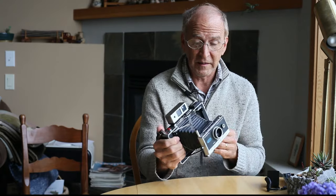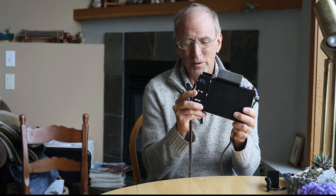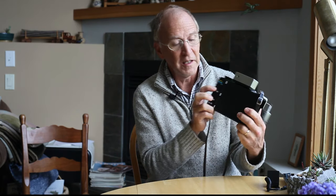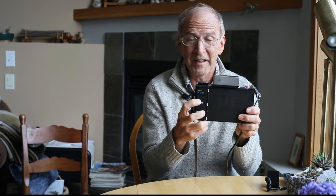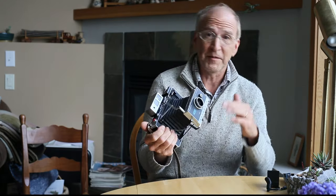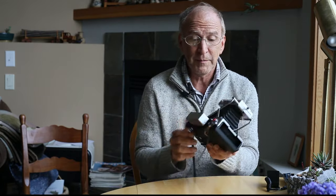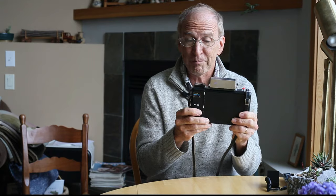What you end up getting is an Arduino-controlled shutter. When you switch it on, you see the little screen — I'll do some closeups later — and it shows the shutter speed, which you can change with these little buttons. The shutter speed is configurable to one third of a stop, which I really like. The reason is that you can only change these apertures one full stop at a time — F8.8, F12.5, F17.5 with nothing in between. So it's really nice to choose shutter speeds like 1/200, 1/250, 1/320, and 1/400, giving you one-third stop jumps so you're more likely to get the correct exposure.